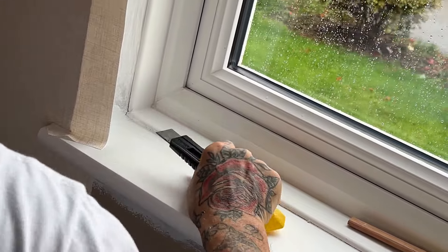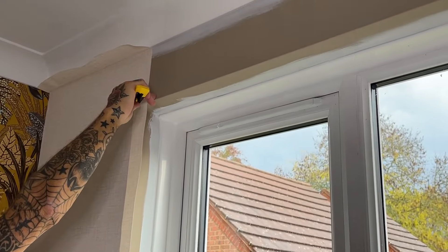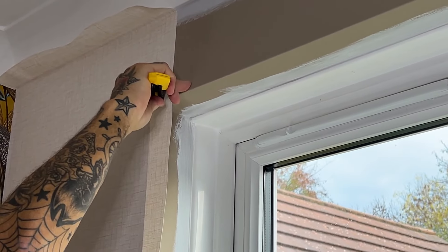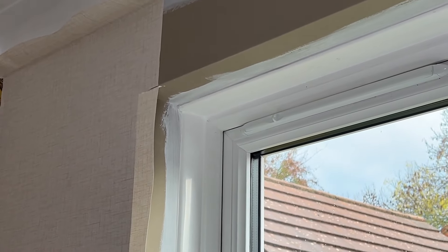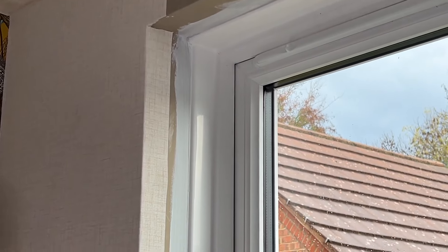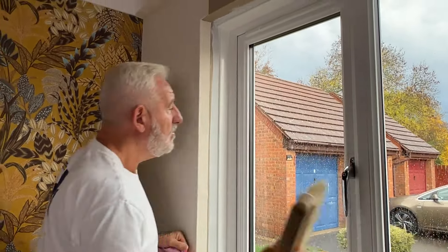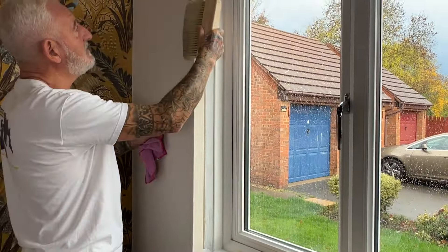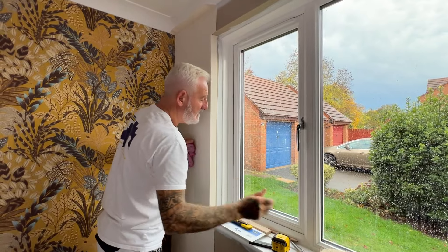Back to the top — where our reveal is, just put your knife tip into the corner, puncture the paper, and then run your blade parallel to the reveal, up against the wall. Then with your sponge, just push the paper around the corner. You can use the wallpaper brush to do the same thing — push it around. You've got no problems using the brush as much as you like, because you're not going to damage the paper. There we go, that's the first step.